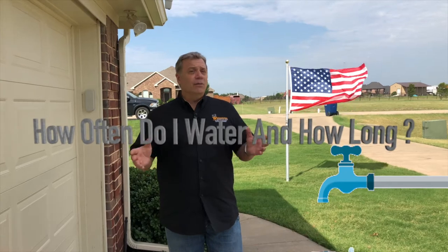The most-asked question is: how often and how long do I water? If you're watering your yard year-round, you only need to supplement the foundation during hot, dry summer months — roughly early June through late September. Run the soaker hose between 30 minutes to an hour each time, and watch for runoff; if water is running away from the house, shorten the time. Water about twice a week when temperatures are averaging in the 80s, increase to three times a week in the 90s, and if temperatures reach the upper 90s to 100s, you can water every single night without any harm.